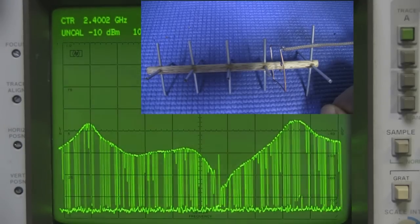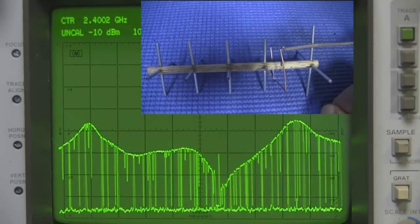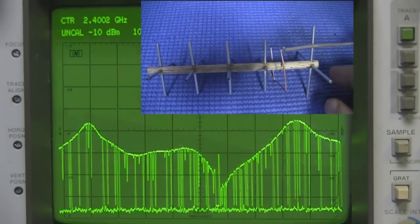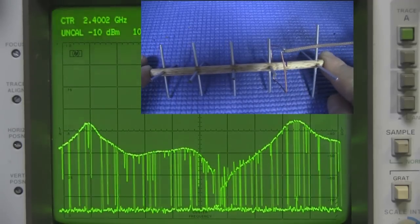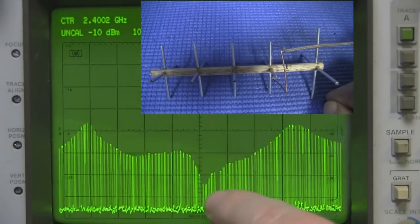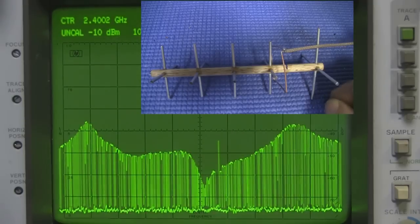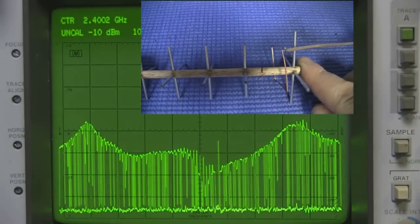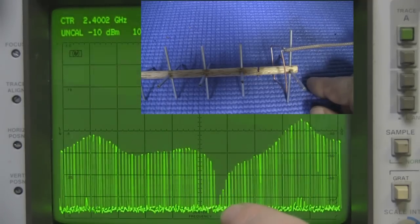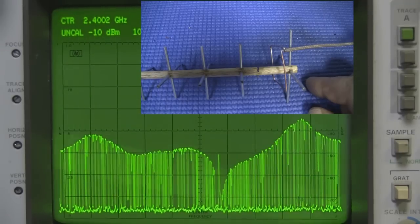The position on the boom plays quite a large factor in the frequency response — I didn't expect it would also affect the center frequency of the antenna, not just the VSWR. Moving it quite close to the first parasitic element, you can see the frequency response has shifted — the center here is 2.4 GHz and it's moved that way just from moving it along the boom. Moving it all the way to the end, close to the reflector — now I'm getting an excellent frequency response with that dip, meaning excellent VSWR, and it's bang on where we want it.